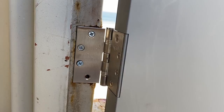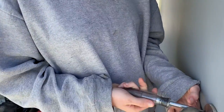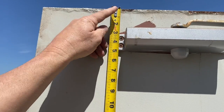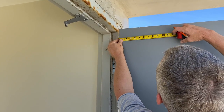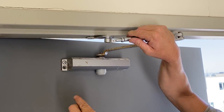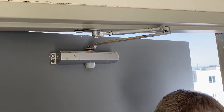We've got all our hinges in. Installing the lock — the hinge is secured, lock is reinstalled. Test that everything's working — it lines up perfectly. The last thing is to reinstall the closer: three and a half inches from the top, seven and seven eighths from the edge. I got the closer reattached with just one screw on each side, pulled it back into place, hand-threaded the bolt — and let's see if it works.